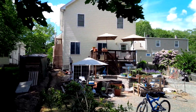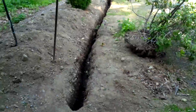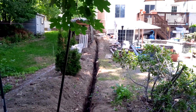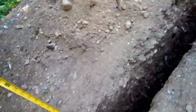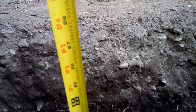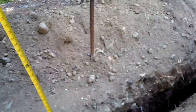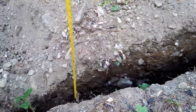For the future garage electrical trench, here's the trench. For the 18-inch requirement, we can clearly see that it's well below 18 inches all the way along.